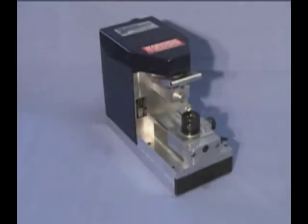If you have a customer that wants a duplicate key, you simply need to decode the key. Once you determine the cuts, use your TKM-100 to make a factory original key. Tubular keys, even originals, tend to be very inaccurate. By always producing a key by code, you can be sure you're making a perfect key every time.